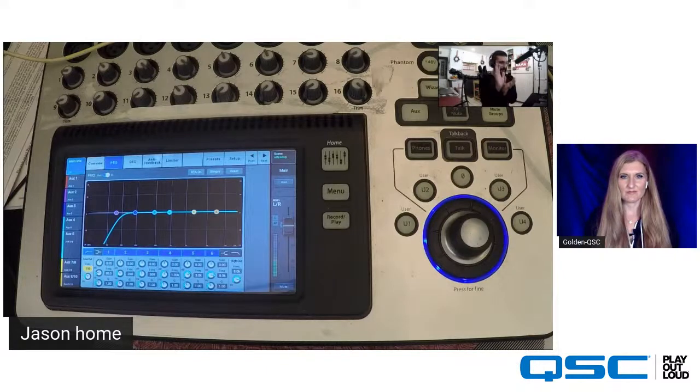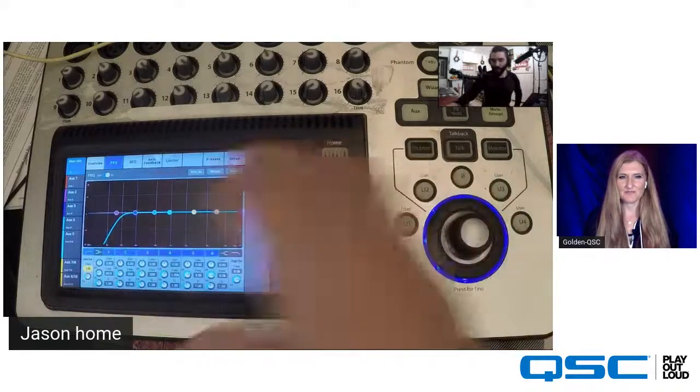Now I've got a 100 hertz crossover between my sub aux output and my main output. So my top box speakers are handling everything from 100 hertz and above. So now they're happy because they don't have to worry about recreating that power hungry low frequency content. We're giving all that to subwoofers and that's their job. And the subwoofers are happy because they're only getting that really low end stuff that is their job. So there you go. You've got your crossover set.